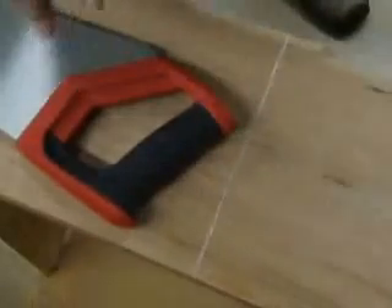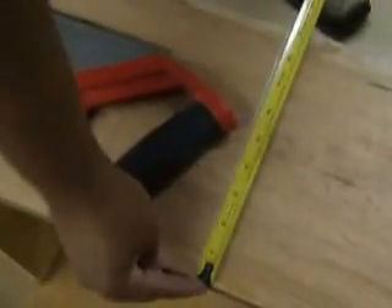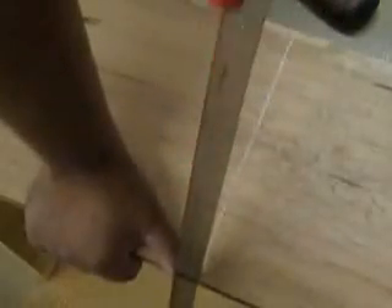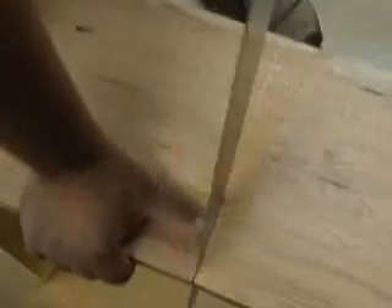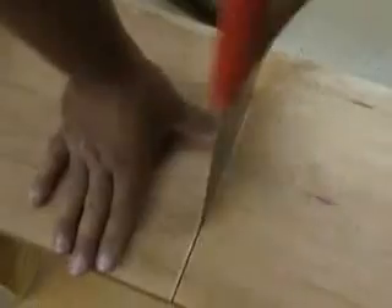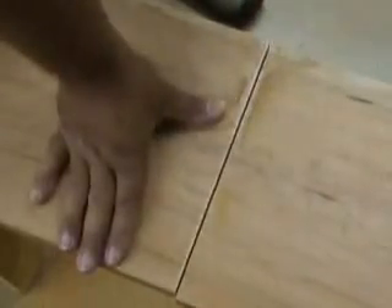This board is going to be used for a side panel, but I can't cut it on the miter saw because it's about 9 inches wide and the widest my miter saw accepts is 8 inches. The finger should point straight out, working as a guide. The thumb lines up right at the line to serve as a guide. Establish that first cut, make sure your board is properly supported, and follow through. Once the kerf has been established, the saw is just going to follow. You can make minor adjustments if you need to. And voila — it's all cut.